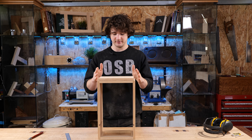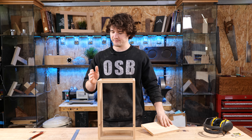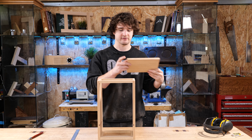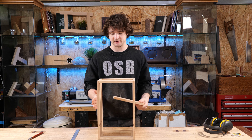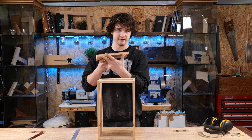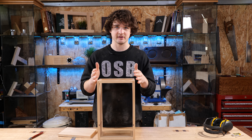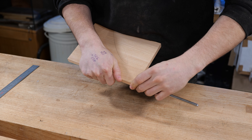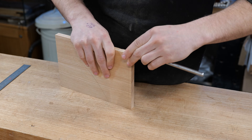It's worth mentioning that because this is solid material, the cabinet may actually be bowing out or bowing in already. In addition, some of these dovetails haven't properly bottomed out and won't do until I give them a nip up with the clamps. So if I'm scribing these shoulder lines and then testing inside the cabinet carcass, that alignment may be inaccurate because the sides might be splaying or bowing. The distance between the shoulder lines on the dovetails are the only parts that can be a fixed datum surface for the shelf shoulder lines, and that's why we've referenced off them.